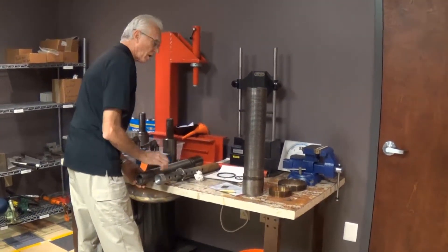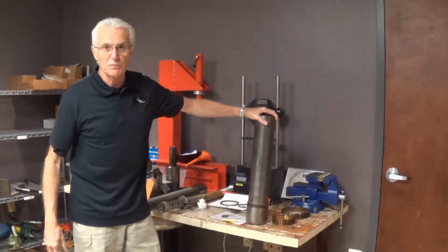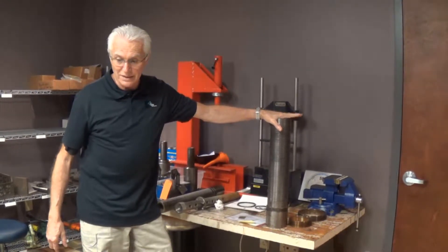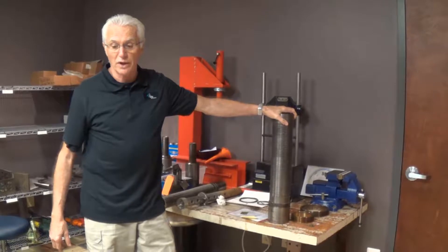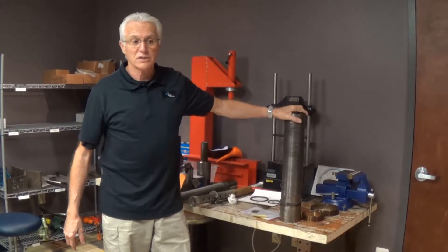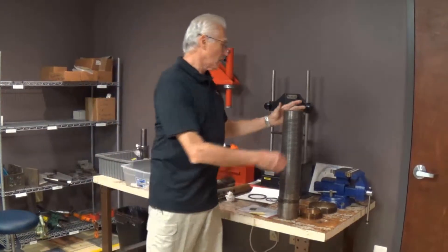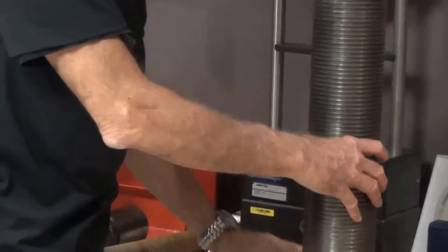Fortunately, it didn't damage the lower cylinder, but it definitely damaged the first stage. It had rusted to the point that chunks of metal had come out and it destroyed the cylinder bore on the second stage. Not hard to repair, but very expensive because it can't be rebuilt — it has to be replaced. Had proper maintenance been performed, it probably wouldn't have seized up in the bore and wouldn't have destroyed the unit. Think of one of these jacks like a small car. Proper maintenance: once every 90 days, inspecting it, jacking it up, lubricating the threads for the lock rings.